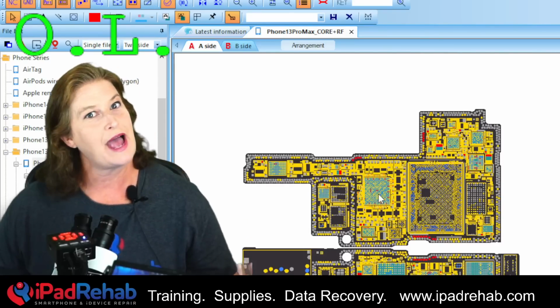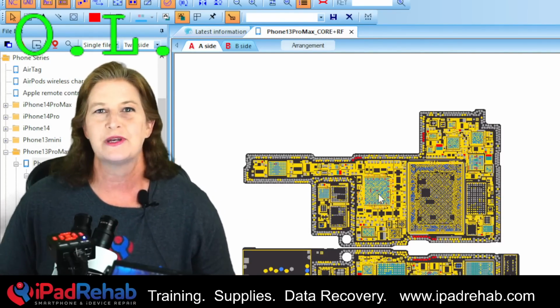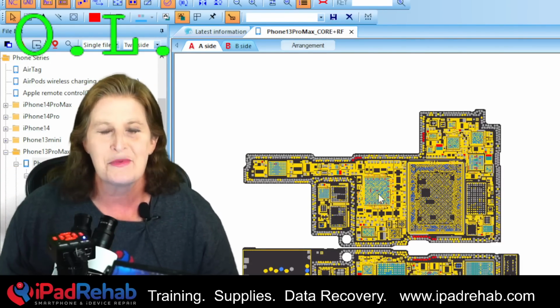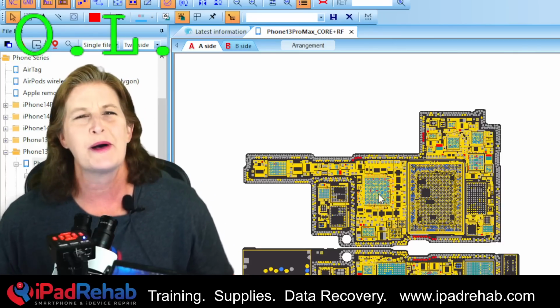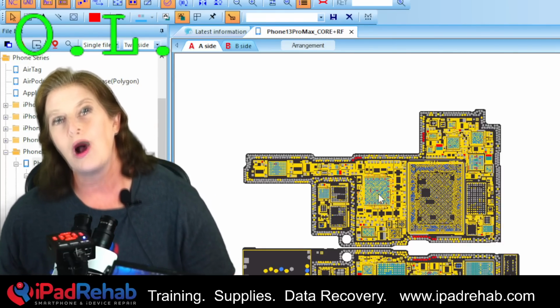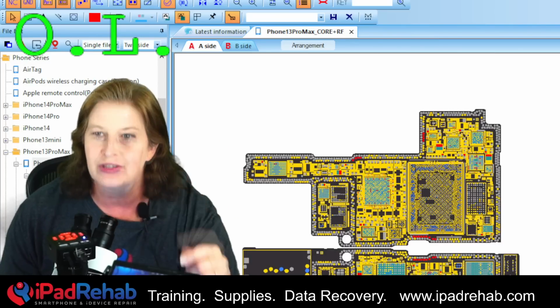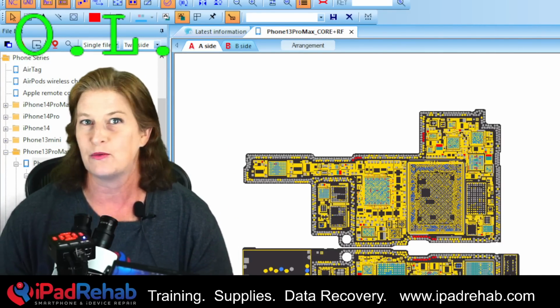Now, I know from having worked on some 13 series before, there's some videos on my channel, one I fixed where the board was broken at the end. I remember that the main power rail is supposed to be the normal value of about 0.3. So 0.1, when it's supposed to be 0.3, is indeed a partial short to ground. There is a leak to ground somewhere on main, but where?